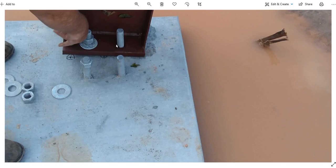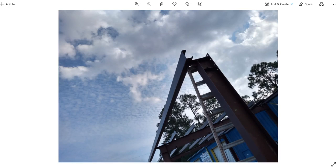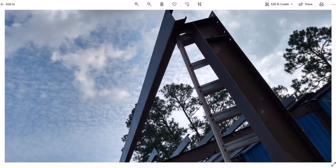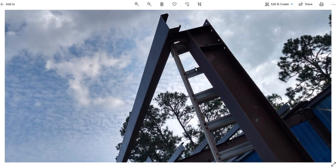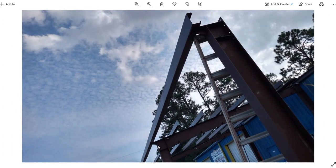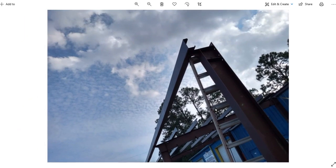On that other corner I was only going to be able to get two to connect. My forklift didn't come in until 2 o'clock yesterday, so I worked until about 8 o'clock last night and got most of this red iron up. As soon as you get your columns up, start with that middle set of columns. Sometimes you hang the rafter first between them, but because these columns were missing bolts, I went ahead and put the eave strut between the columns first before I bolted the rafter up.